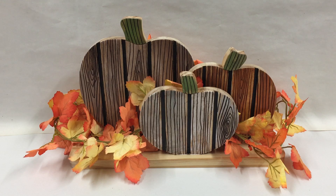You can set it on a shelf, a mantle, or a table, or whatever you'd like. I used the V-Carve software to create the entire project, and the wood grain that you see uses a V-bit to cut shallow pattern grooves into the wood for an old wood slat appearance.